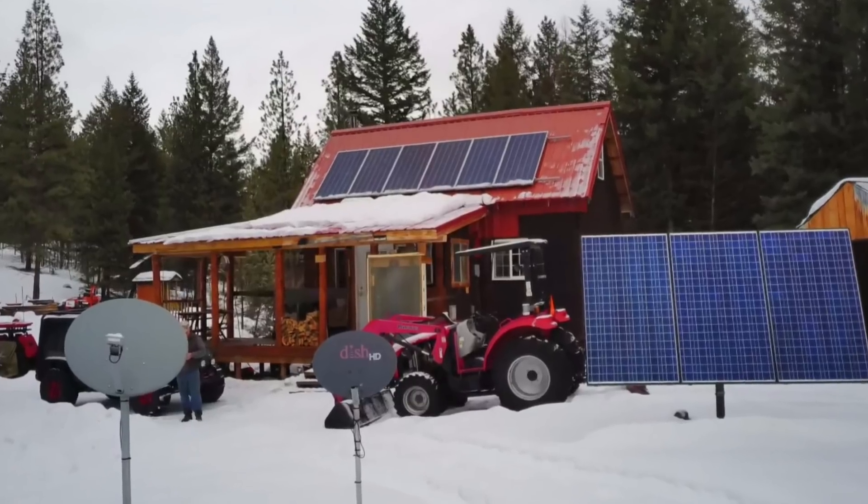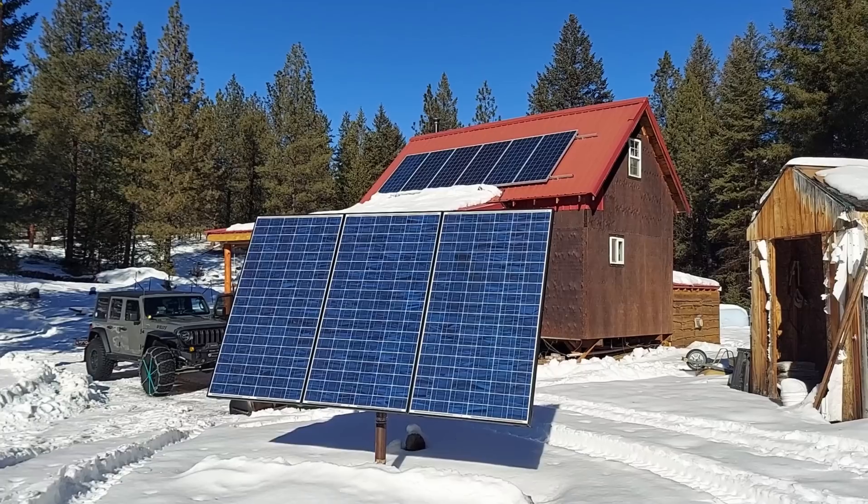Let's take the last time I was at my cabin. In the morning, my batteries were at 26.4 volts. When the sun starts to hit my first array — which is really steep right now for the winter, but that way it can catch reflection off the snow — that first array is going to start sending power to the first charge controller right away. When it gets enough voltage and amperage, it's going to try to hit that target of 29.1 volts.